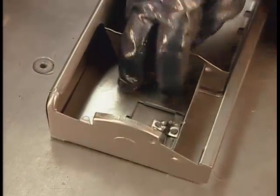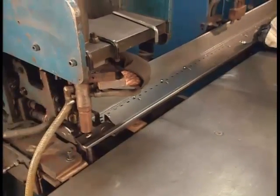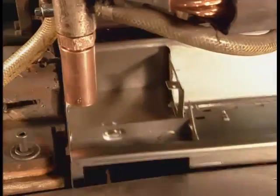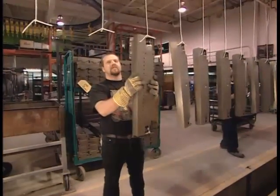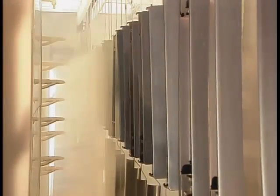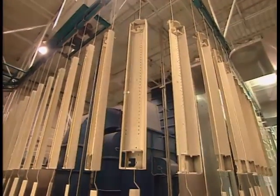Next, they put a steel junction box on each end of the casing. These hold the wires that the electrician connects to the house wiring. Workers spot weld both junction boxes simultaneously. After a thorough washing, computer-controlled sprayers coat the casings in paint powder. Then it's into an oven for about 20 minutes at 185 degrees Celsius. This transforms the powder to liquid, drying it instantly.